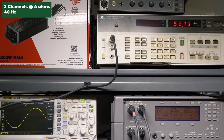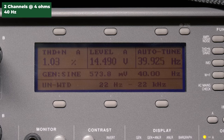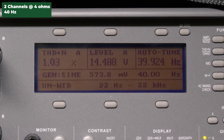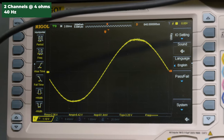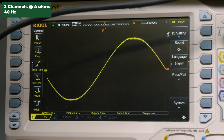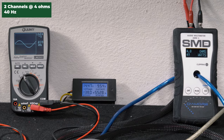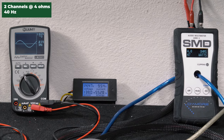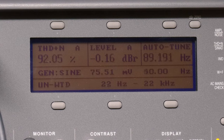Going to 40 Hz, our HP picked up 53.66 watts RMS at 1.04% distortion and 14.4 volts. After swapping channels, the AMM1 read 49 watts. We got 14.54 volts on the Lumi and drew 9.54 amps of current. Our final test was frequency response, using our audio precision to run up each frequency.